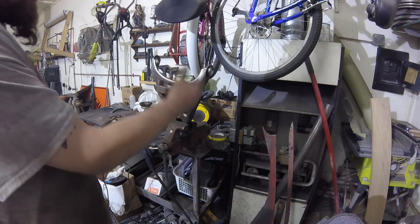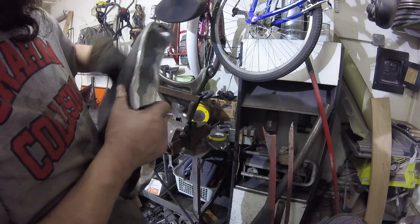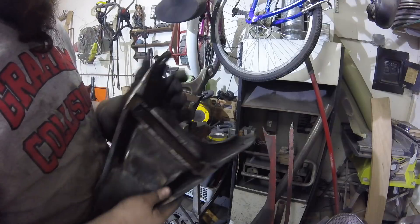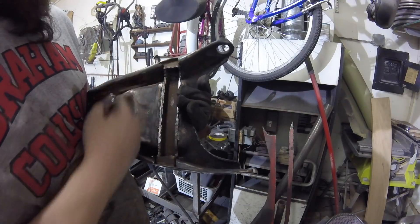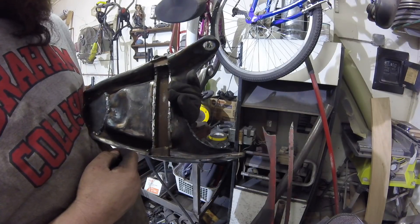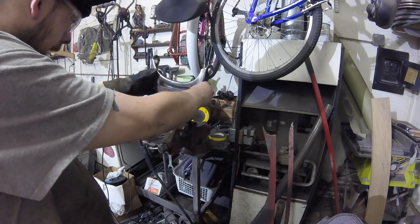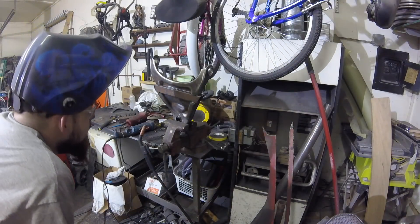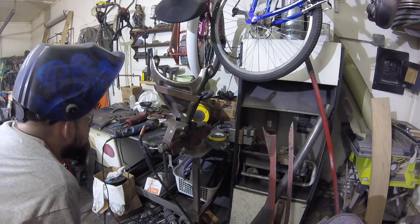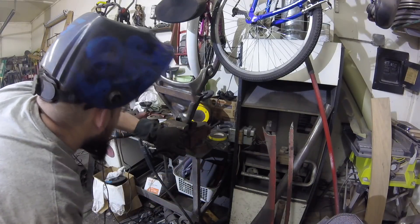When I did the sides on the other one, the plate I made fills in that difference, so you can't really tell. But if you look inside, it's the same deal. You just got to try to line it up as good as you can and then weld it up. Spend some time here making sure everything looks right and is sitting the way you want it to sit. You can change it now — you can't change it when it's all wrapped.